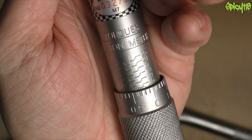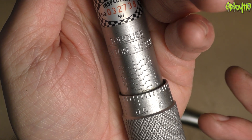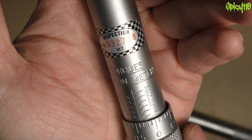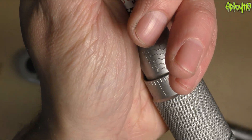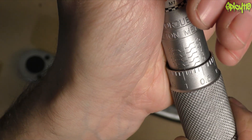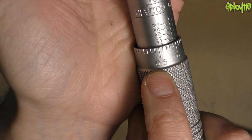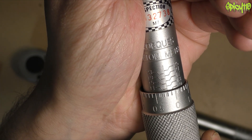That's where the larger torque wrench only gives you full numbers. On the smaller ones, you're going to get decimal values. Generally, just round it up — it's not going to be that important. But if you are in a job where decimal figures are important, the way you would do it with a smaller one: let's say we wanted 9.2 newton meters. Same system — loosen this off, screw this up until it says nine. And we're at 9.2. It says 0.5 and one, so these are obviously tenths. And you go 9.2.